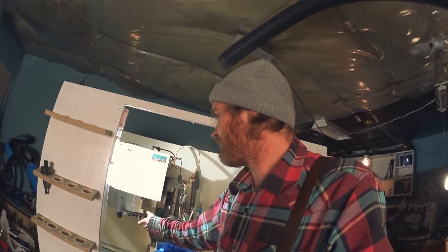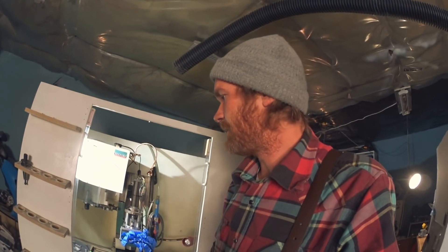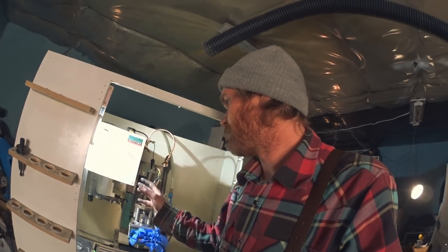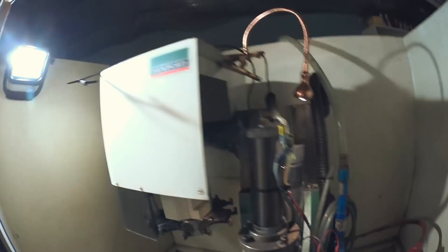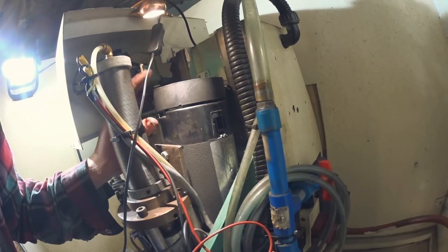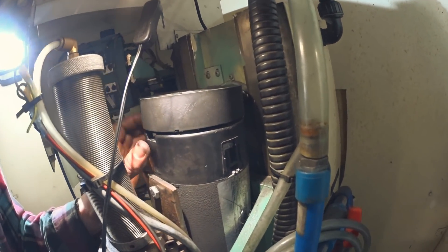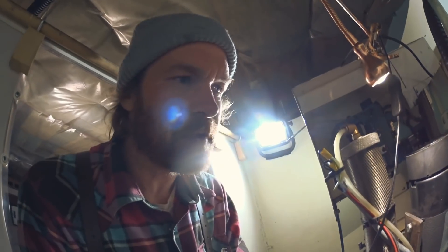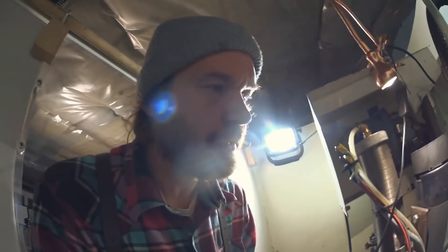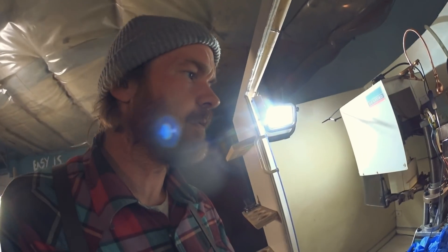The tool changer is working but the commands are not corresponding with the numbers on it, not sure why. The limit switches are being triggered so there's some fishy stuff going on, but it's working. Currently removing the motor, which is a retrofit - it looks like a treadmill motor. The broken brushes are due to the armature; someone mentioned it in the comments too. There are some loose bits that broke the brushes. Already ordered a new one - we'll be operational as soon as we get the new motor and the new stepper motor, which is also ordered.